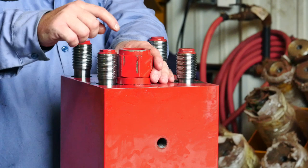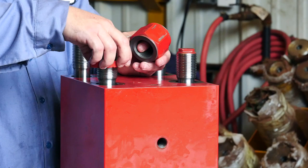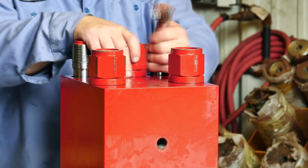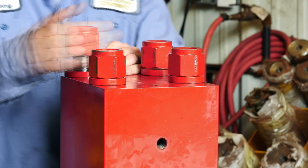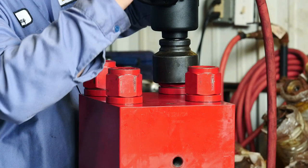It is very important to make note that you want full thread-to-thread contact between the top nut and the through bolt. You also do not want to bottom the through bolt down on the front head, so it is very important to get the height correct on the through bolts. You will screw the nuts down on them and you can adjust the through bolts to make them where you need them. Once you have the correct height, use an air wrench to tighten them up in the X pattern as noted earlier.